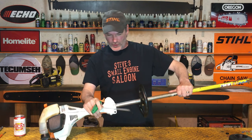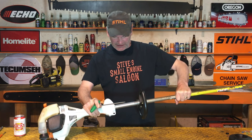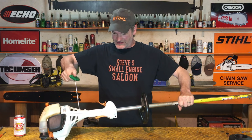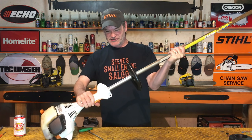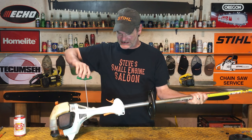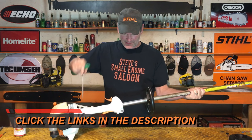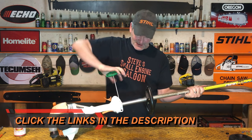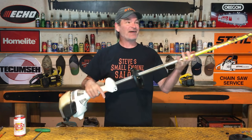There - it just locked in. See that? I can't pull it out, I can just wiggle it a little bit. That means that locating screw right there is actually in that hole. It still wiggles a little bit - you just have to tighten up those other four screws nice and tight. And that is as simple as that - the shaft is changed, it's done.